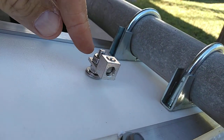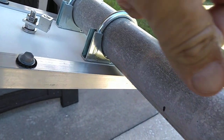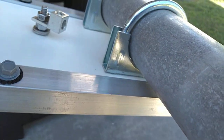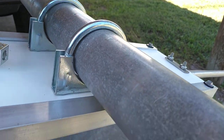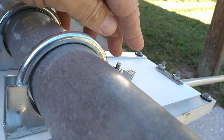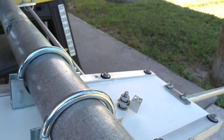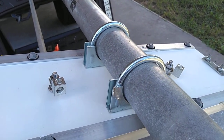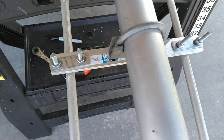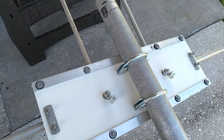You can put eyelets on your coax and directly bolt them, or you can use aluminum or copper blocks. Your coax comes up, you split it — you've got to have enough reach so your center can go to one side and your shield to the other. Between this bolt and this bolt I measured seven inches, which gives me plenty of spacing so they're not close enough to the boom to arc over. That's what this piece looks like from the other side — this is part of your adjustment to get your ohms and SWR matched up.